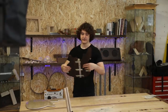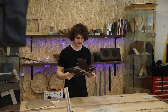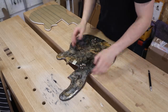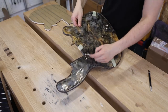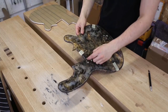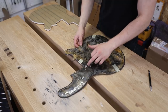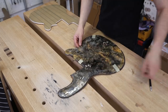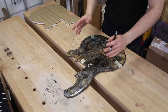I took this top out of the clamps and the veneer is sitting nice and flat. However some of the glue hasn't properly dried around here, but this isn't necessarily a bad thing because it's pretty solid around all these edges — the veneer is fixed on. It's just in these voids in the middle where air couldn't get to it while it was being pressed. The veneer has got a skin on it but it's still a bit wet underneath, which means I can cut this excess veneer off and clean the glue off while it's still wet. I'm going to make the most of this opportunity and get clearing it out.